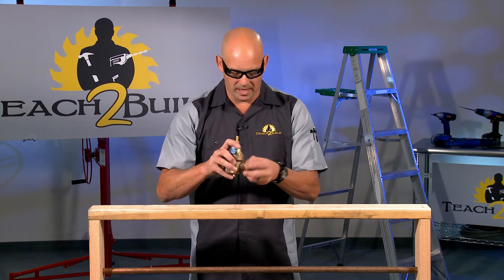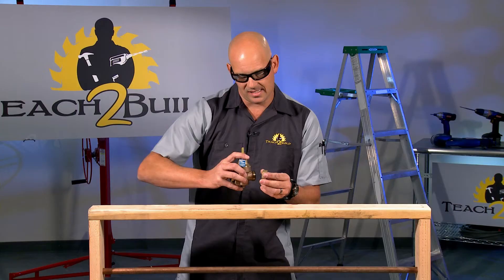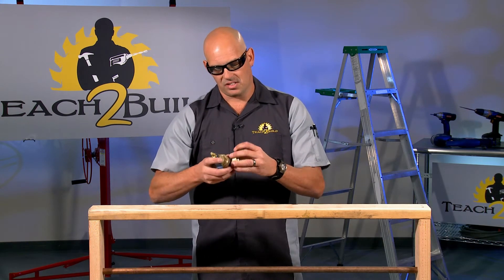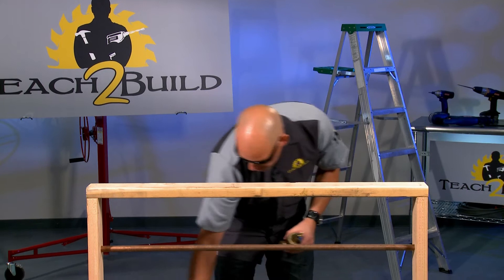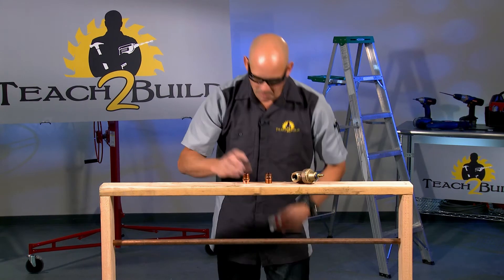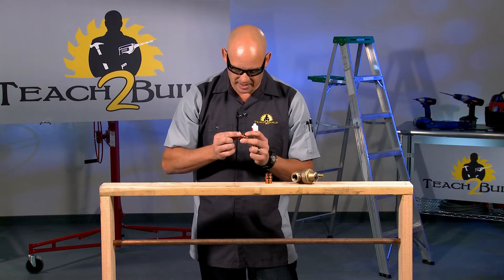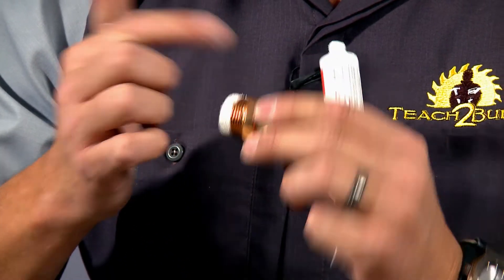The pressure regulator comes with a flanged fitting on one side with a rubber O-ring, which allows you to slide it in under closer tolerances, get it together, and then turn the nut to get it locked up tight. You'll still need to put fittings on both sides, but this allows you to get it in there in a much tighter circumstance. For copper, you've got three-quarter male fittings that go to three-quarter copper. This is a threaded fitting, so it's going to need some thread sealant — T plus two is a really common one. Make sure it's in the initial couple of grooves all the way around, then thread it into your fitting and you're ready to go.